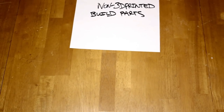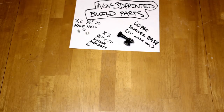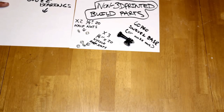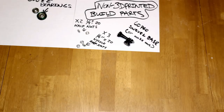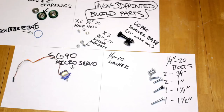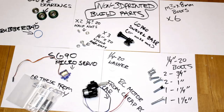I'll put a package of all this out on Thingiverse so you can download them and print them off if you'd like. The actual parts of this build that aren't 3D printed are just quarter-twenty bolts — a couple 1-inch and a couple 3-quarter-inch quarter-twenties. I modeled it with quarter-twenty bolts because quarter-twenty is what cameras accept. The bottom of your camera and GoPro camera mounts will be a quarter-twenty. It just makes life a lot easier to use the same size for every part of the build.